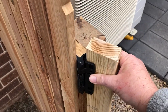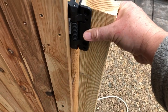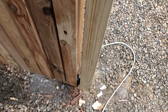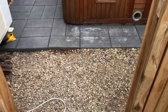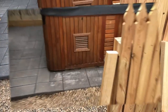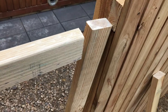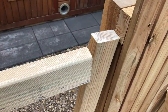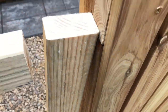I want the strength to be on the upright, so I want the hinge to be connecting with the vertical piece here, and the same down the bottom. We're going to screw this together in a big square, then put the cross beam on it which gives it its strength, and then put the pickets on to finish it. Measure across for your gate. In my case I'm going to do a butt joint on both sides, which will make the big square frame, with one across the bottom as well.